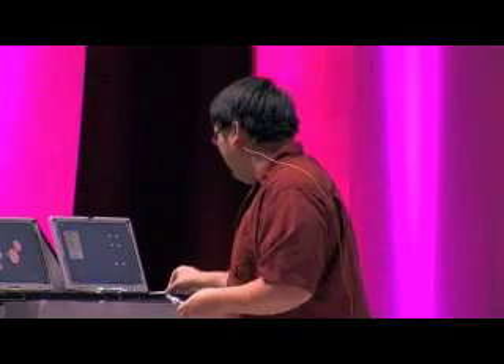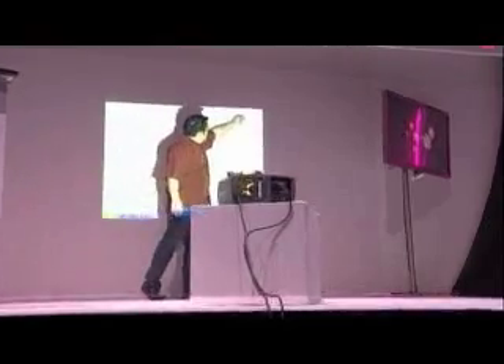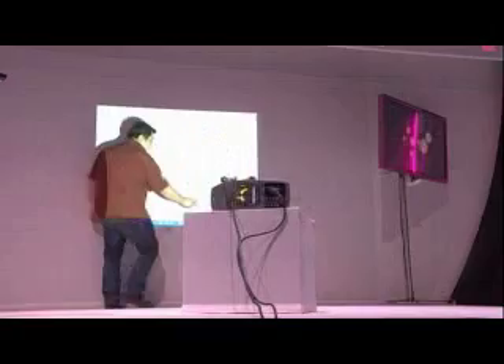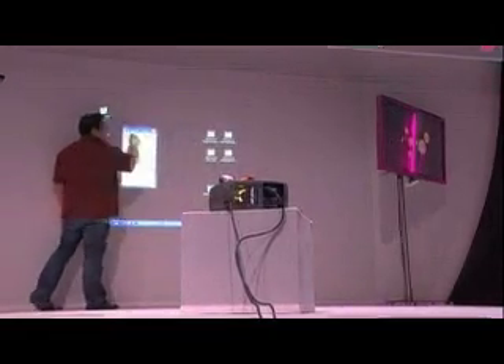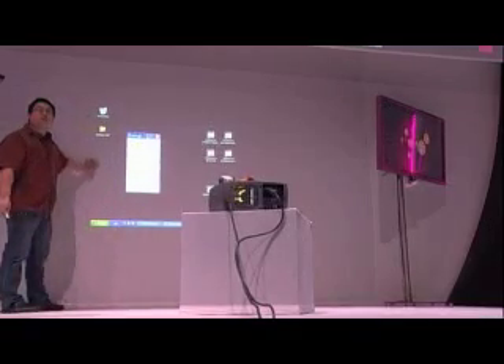This is a pen that actually emits infrared light. It's a simple device — you could probably make one yourself with a quick trip to an electronics store. All it does is a battery, a button, and an LED. When I press the button, the LED turns on. Using the software, it reads data from the Wii Remote, and when I press the button, the camera can see where the pen is. By doing a quick calibration, I can now control the mouse cursor with my pen. So this little piece of fabric is now an interactive whiteboard.